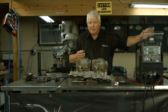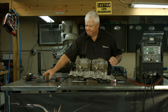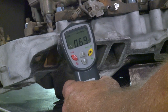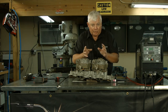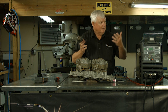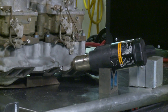In this particular case, we have a machine with plenty of amperage — we just haven't hooked it up water-cooled. For our purposes, we're going to do this air-cooled, because this is really the best portable way to do weld repairs. I've taken an infrared thermometer just to give you an idea of the temperature of this casting. Castings typically are pretty dirty with a lot of oxides on them. I shoot this on here and I see it's 68 degrees. I'm going to show you a couple of techniques — do a little pre-prepping, get rid of the oxides, put a little channel in there so I can weld and get rid of the crack. Before I start welding, I'm going to preheat using a heat gun. This just plugs into 110, and I'm going to hold it on there. You can even walk away and let this do your preheating. It doesn't matter how much preheating — you just want to get the shock away from when you get ready to weld.